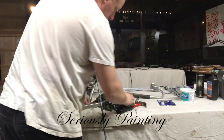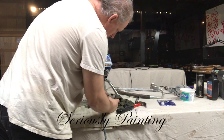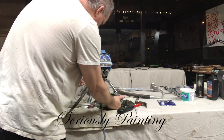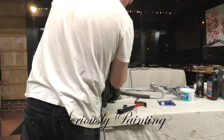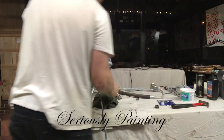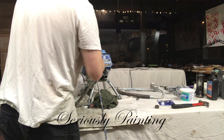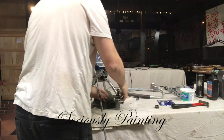Okay, the first piece that we get off after we've removed the pump from the machine is that brass ring. The brass ring at the top is threaded in, normal thread, and you just take it off with a screwdriver and a hammer. You can actually loosen it while it's still in the machine, or wait until it's out, and either a slot screwdriver or a square Robertson type of thing. And just knock it loose a bit, and then you'll be able to unwind it. It's got a seal on the top and an O-ring on the bottom.